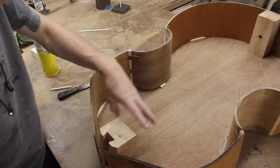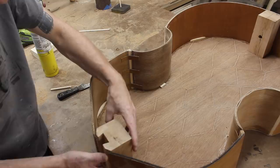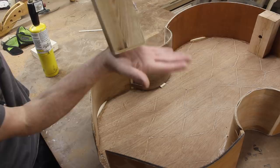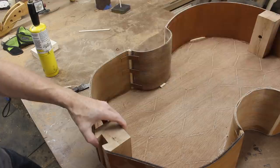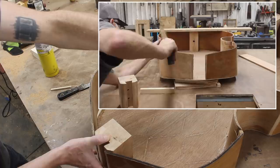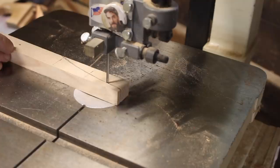I made a couple of rookie mistakes I didn't notice until I flipped this thing over. I should have just done the sides and not tried to glue the blocks in at the same time, because this block was a little bit crooked. Also, since the back slants, the block should slant too so it gets a full purchase — instead it kind of floats with only the tip making contact. So I'm going to glue some extra wood onto the bottom to shape it to fit the body, line it all up straight, glue it in, and clean it all up.